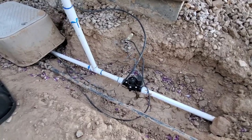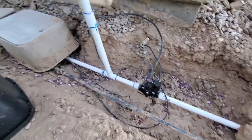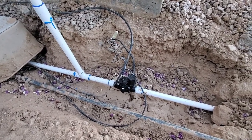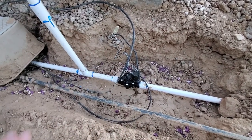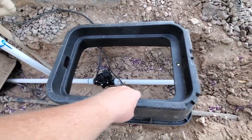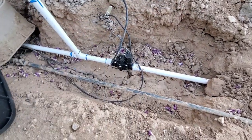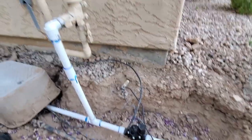One of the common misconceptions is that the valves actually go inside these boxes. It's really more like the box goes on top of the valve — it's literally just going to sit on top of everything. You don't want the boxes to actually be pushing on the PVC pipe and crushing it. We'll work on situating this where we want, lowering it down, and then building up a base underneath it to keep the bottom parts from crushing down on the pipe.